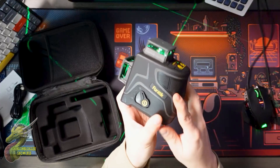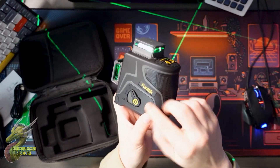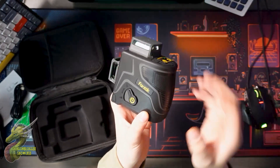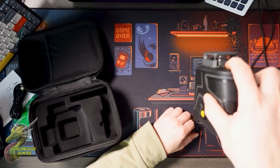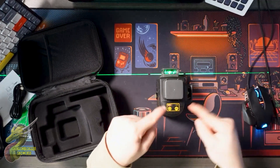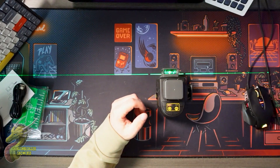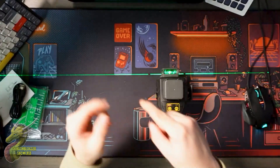This is not just a two-way laser level. What this is actually going to do is map out your entire room so you can check the level of walls to the level of your floor and make sure everything is flush all at once. This is going to be your horizontal laser. Whenever you're setting this up, it recognizes that it's not stable and that's when it starts blinking. So if you see that laser blinking, you need to readjust this in order to get it in a stable environment for that leveling process.